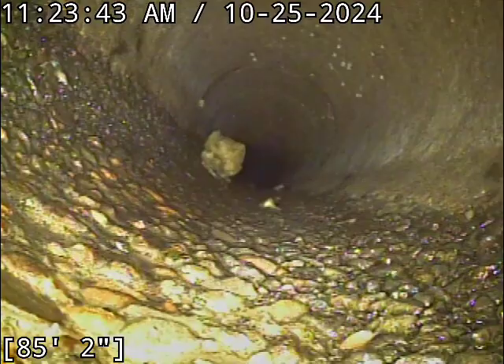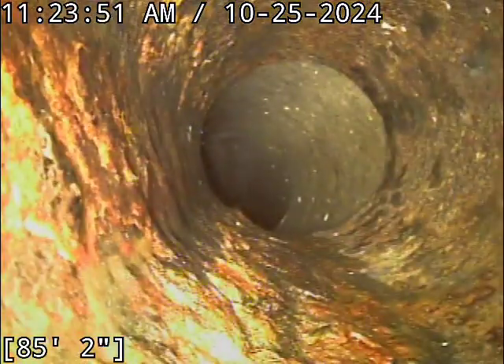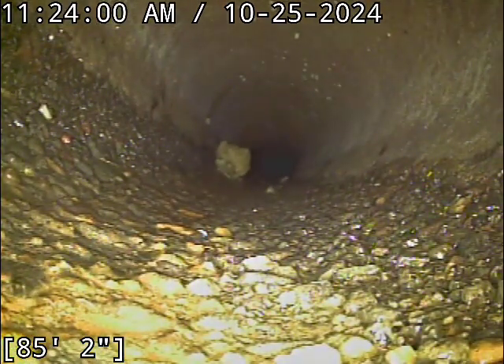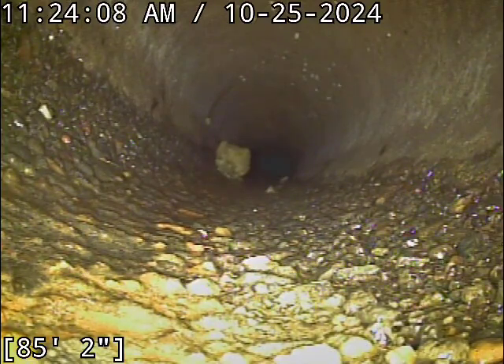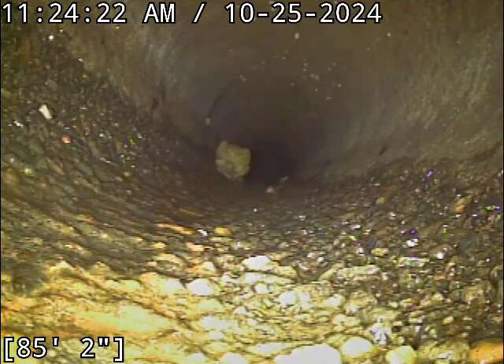I'm going to locate and see where we are currently. You've got a spot there — that joint that's starting to wear too. I'm actually leaning more towards what I hate to see happen: letting this thing go for too long and ending up with the line opening up to the ground, resulting in settling or hydro erosion issues. Nowadays, with the advent of trenchless epoxy liner systems — which in most cases save quite a lot of money — it behooves you to get ahead of these things and not wait for the line to turn to Swiss cheese and open up to the ground. It leads to settling problems, and once a line settles too far and gets too far gone, you'll lose the ability to do a trenchless epoxy liner and you're looking at a much more expensive traditional style repair.